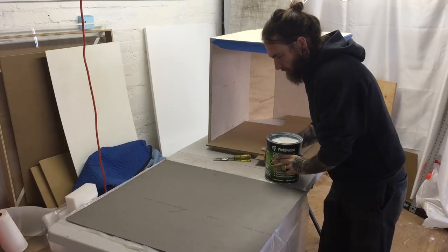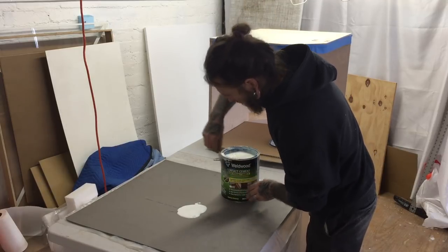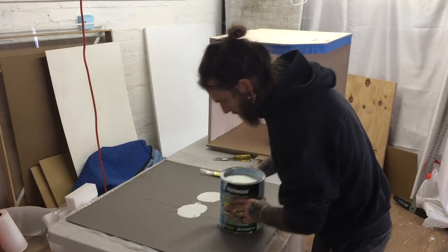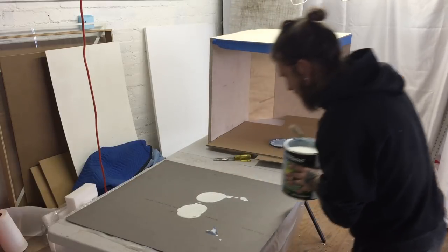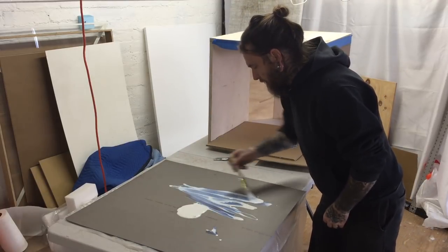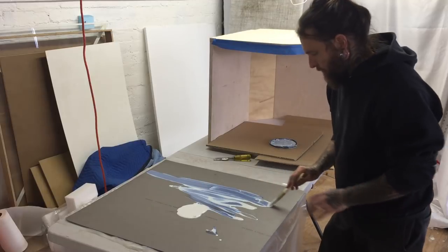This contact cement, you just kind of pour it. You can squeegee it or do whatever. It's kind of hard to pour with this amount. You just get good coverage on your whole surface. And then as it starts getting a little tacky, my friend Noah says he watches for the shine to slightly go away. You paint both surfaces.